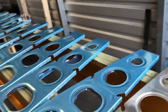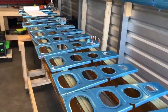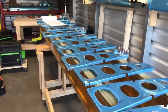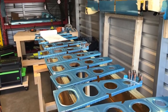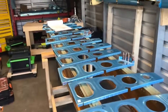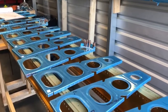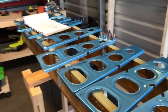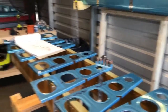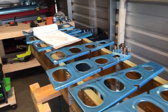All of the parts are now fluted and ready to go. Tomorrow we get to take all the bluing off, do all our deburring on the lightning holes, and we'll talk about that when we get to it. After deburring, we're going to scuff all the pieces up, run them down with acetone, use the new painting table, and paint these parts.